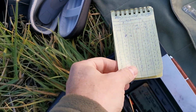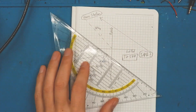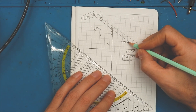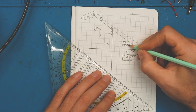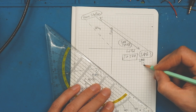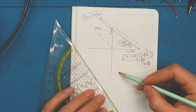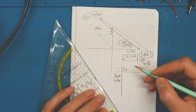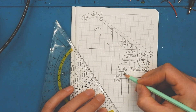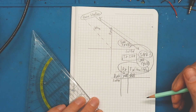During the test I switched the antenna after each transmission in JS8Call in order to reduce the effects of the constantly changing propagation. I sent an SNR request to my home station; the home station then replied automatically and I got the signal-to-noise ratio for reception in the field with my Lab599 TX500. I also get back in the text reply the SNR for reception from the home station, which is more or less the result of the transmission. I write down both numbers: reception SNR and transmission SNR.